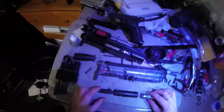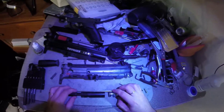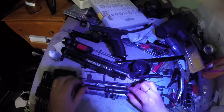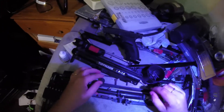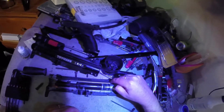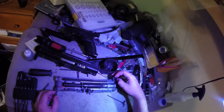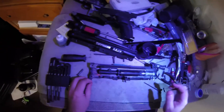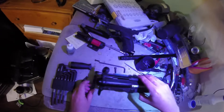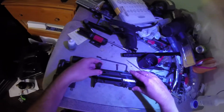Getting everything back in place: our bolt, our power tube with the valve core in it, a linkage arm, and the hammer - or as Tippmann calls it, the rear bolt. When you get this in place, make sure the opening on the power tube is facing down so the tombstone can slide into it later. The return spring for the cocking handle - I like to clip three rings off of it so it'll sit nicely in place; otherwise you need about five hands to hold everything while you're trying to put this thing together. Here goes attempt number one - just line everything up, slide it in place.